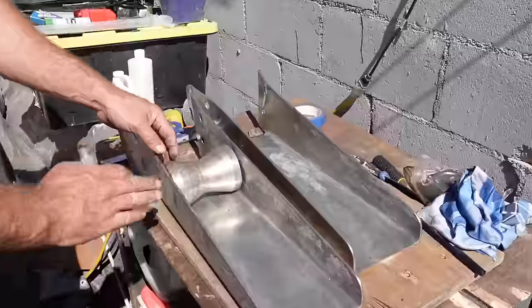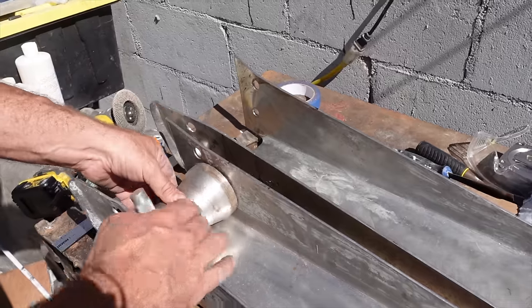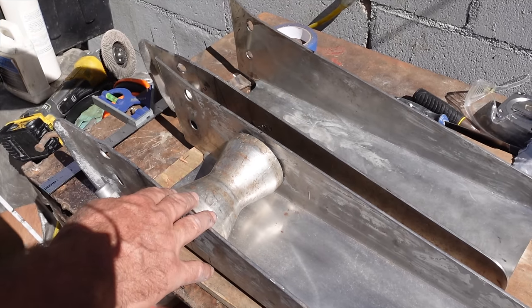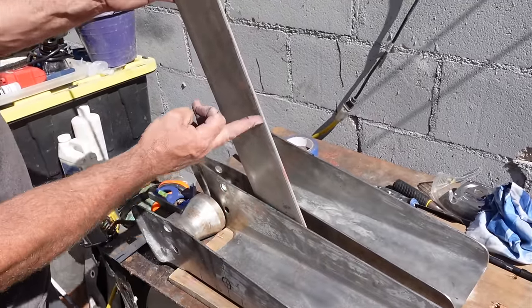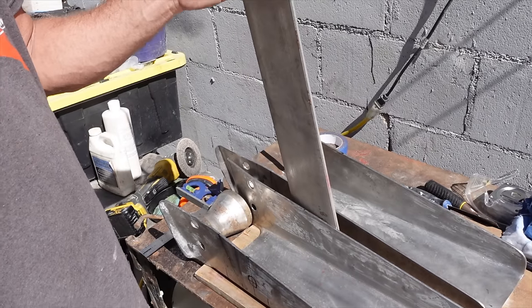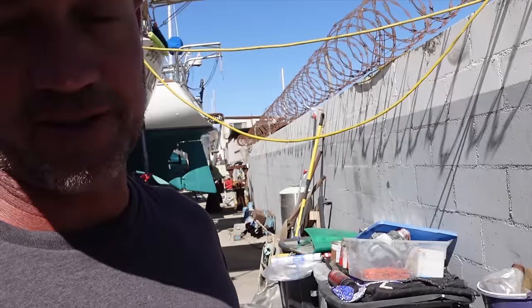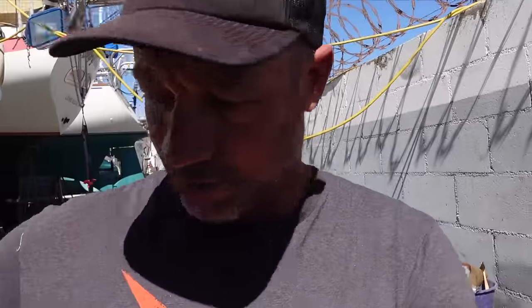It just means my wheel is going to be a little bit higher, but we are going to put that bar across so that should take care of that. It's not ideal - we did have a bit more of a lip here to stop the chain from running out, but we are bringing it back shorter so we haven't got so much of a lip now. So we're going to put a bar up over the top of this on both sides and that's going to stop the chain from coming out. It'll come up to about here and then come across both of them and down again, with a little bit of reinforcing in between. I'll probably get it all cut out and hopefully tacked together today. I still need to polish everything, get it all as clean as possible, and acetone it all before we weld.